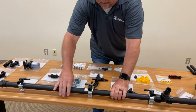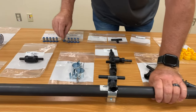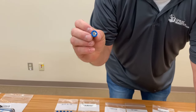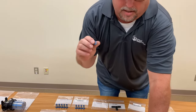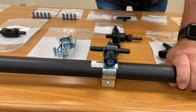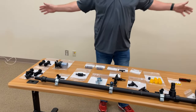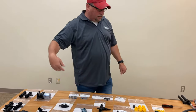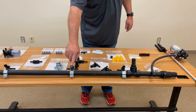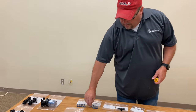So in here I like to put a check valve. We have 50-mesh tip strainers with a built-in check valve in them. So what that does is when you turn your pump off and shut that valve off, when you get below 5 psi, that's going to stop this nozzle body from dripping. So you're not dripping all over the yard — or if you're spraying Roundup on your driveway and want to drive back through your yard, you're not killing little strips. When the pressure in this line gets below 5 psi, it's going to stop it from dripping. Plus you're also getting a 50-mesh strainer built in so you don't plug your nozzle.